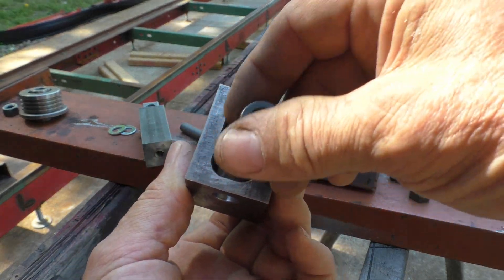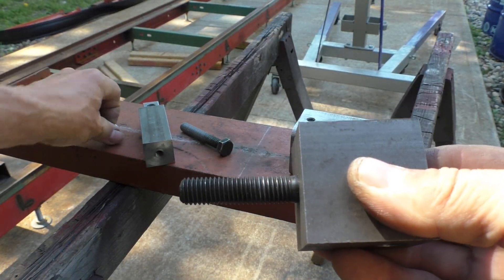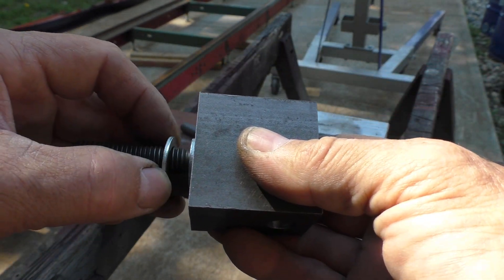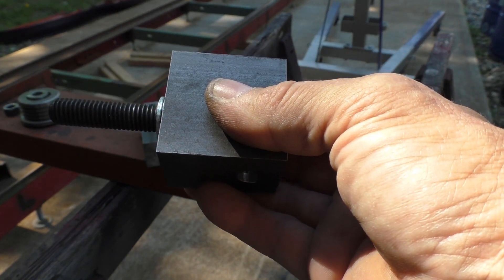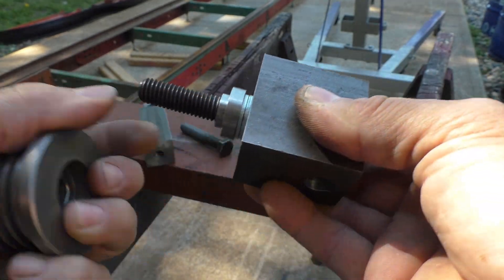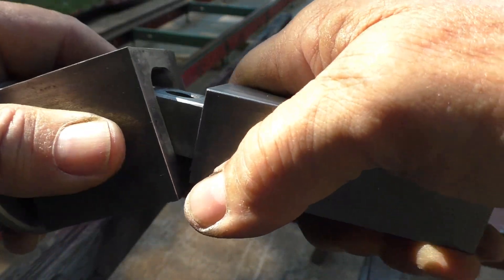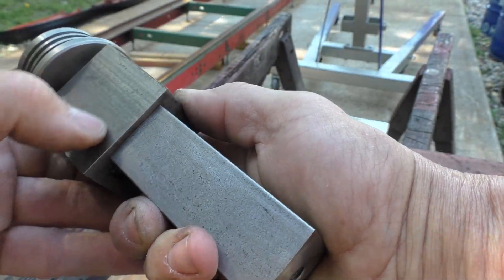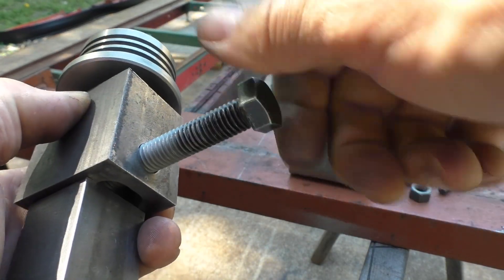So we'll show how this thing's put together — I'm using a cap screw in here. For adjusting the rollers in and out, I've just put shims on here. What I plan on doing is removing one of them after the saw is all built to get the distance of the roller away from the blade. You'll be able to adjust the length of this thing in a couple of different ways, but this is the easy way. The bar with the threaded end goes into the block — that's a tight fit. I've seen some of these outfitted with set screws, and I'm guessing that's for larger tolerances; I made mine kind of close.